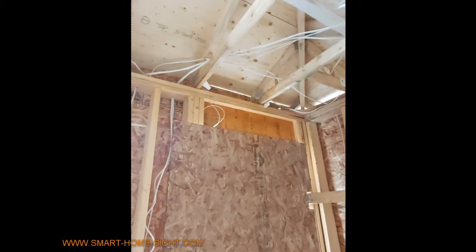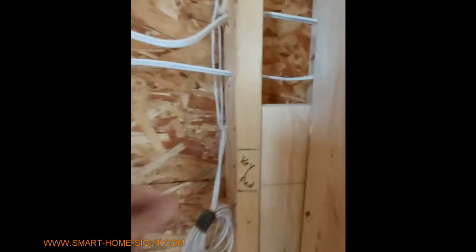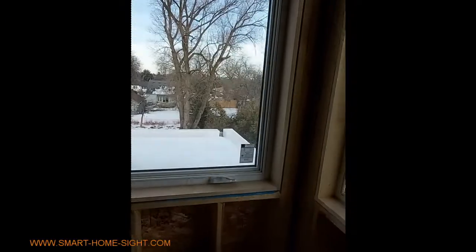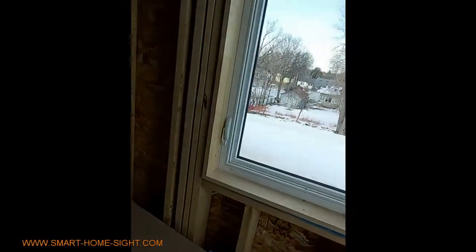In this bedroom we have one door contact for security alarm, and this is a keypad — we just ran two quad wires. This opening is covered because we have access to the balcony and anyone can come inside, so we covered this opening. The other windows have no door contact. And that's it for the second floor.